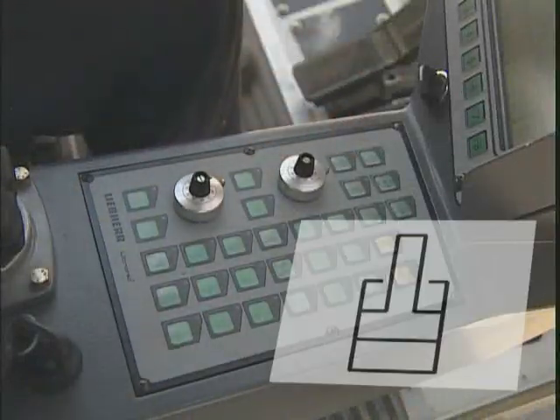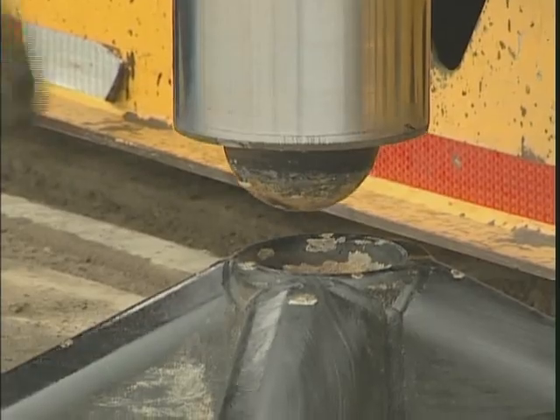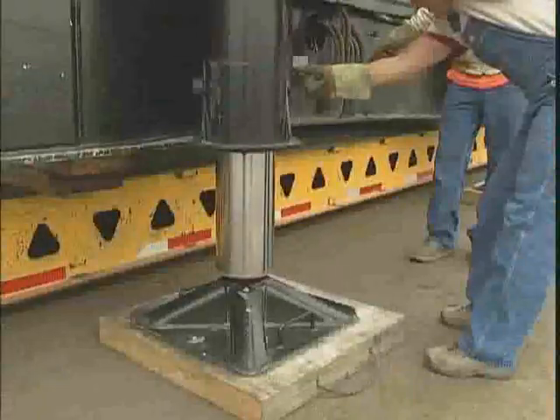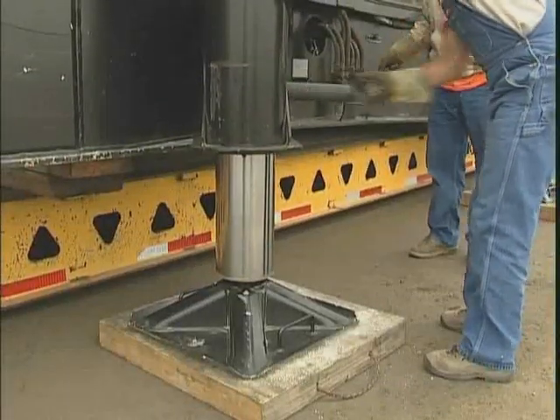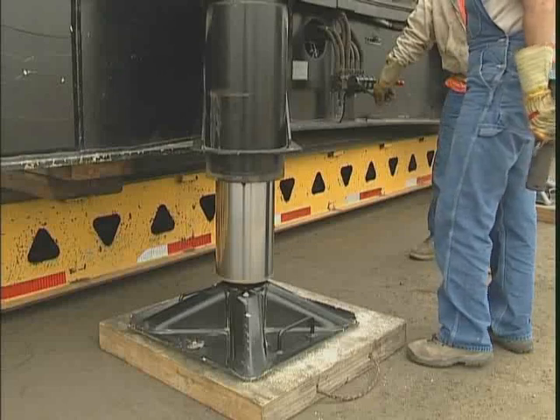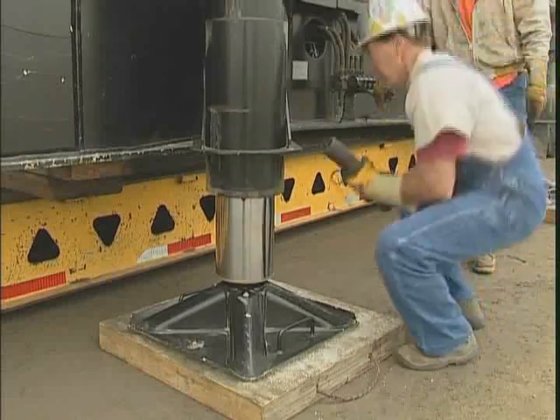Select this button to send the hydraulics to the jack-up cylinders and slide the cab into position. When utilizing the jack-up cylinders, make sure that they are fixed with the pins in the lower position so that maximum jack-up height is available.